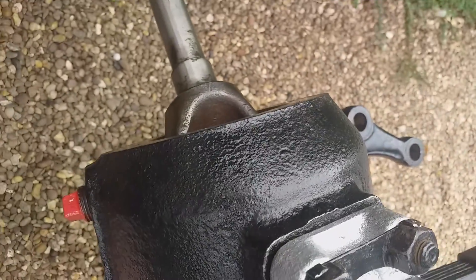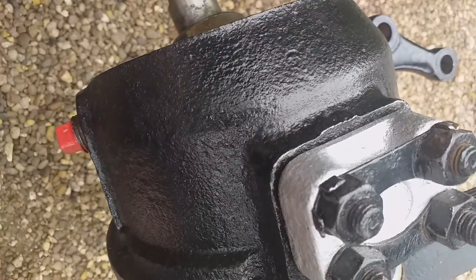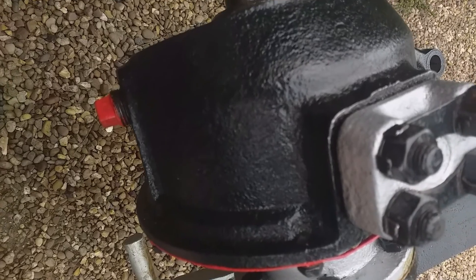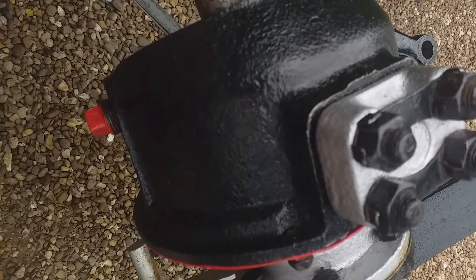I'm going to put the half shaft in nicely so it connects up. Now when I turn the diff the half shaft still doesn't do anything — we need to make sure it's going to rotate, and when it's at the right angle there's 55-thou clearance.